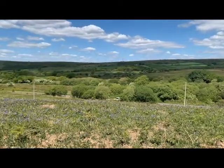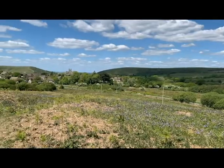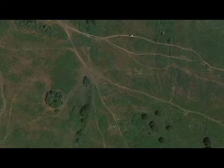The first step though, when you get out into the field, if you're not relying on GPS technologies, is to figure out how you're going to orientate your survey and reference your survey to something in the real world. Now, doing it in the most basic sense, i.e. with tapes and measures, I would look around me and see if there are any fixed points that I can identify on Google Earth or on aerial imagery or on Ordnance Survey maps.